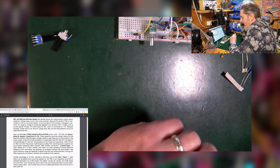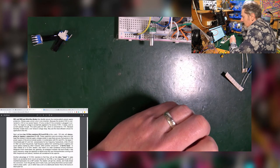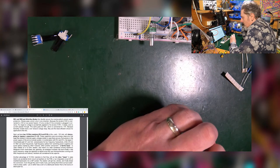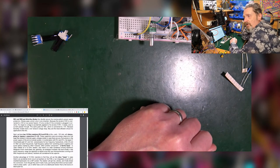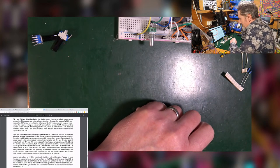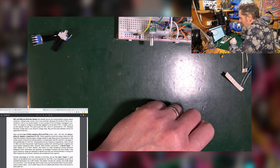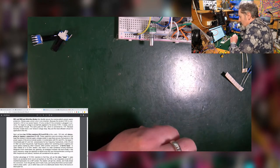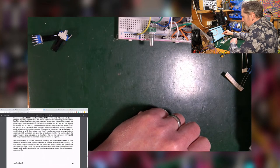Often another component is a ferrite bead. Yeah. Which is used instead of a 10 ohm resistor. Okay. There's no clear consensus among designers which one works best. I've often had to solder in ferrite beads, having no real knowledge of what they do other than something to do with electrical interference. But for analog modules that work mostly in the audio range, resistors are considered to be superior. Fair enough. Another advantage of 10 ohm resistors is that they will act like slow fuses in case there's an accidental short circuit. Helpful. It will get hot and smoke and finally break.